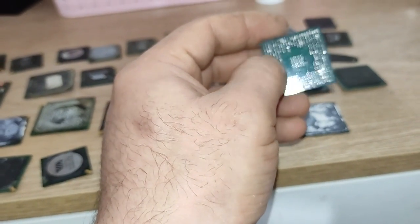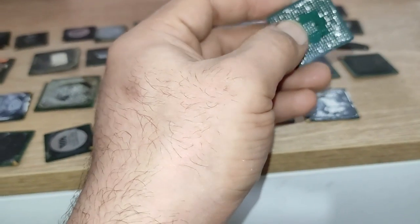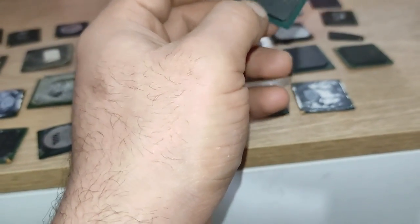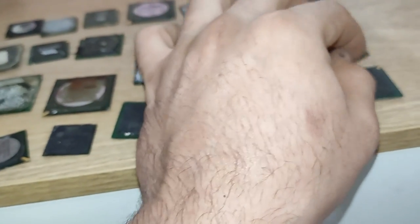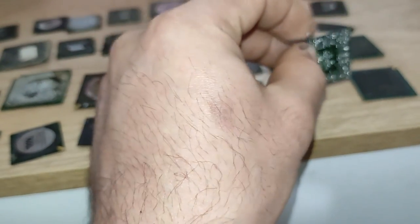Another way, and a bit more expensive way, is to use nitric acid. Nitric acid will form metastannic acid from tin. Silver and lead will form their corresponding nitrate salts, which are soluble in the solution. That's why I prefer to use nitric acid instead of hydrochloric acid.